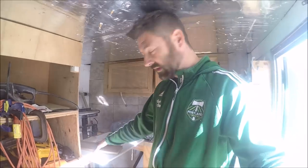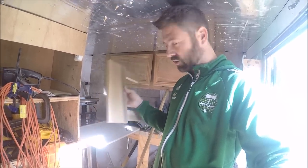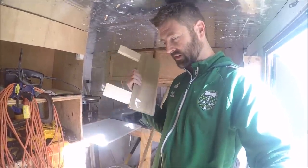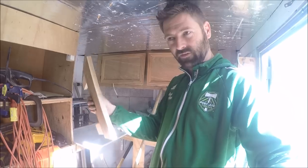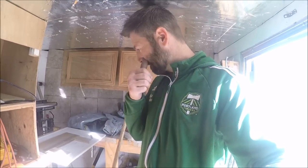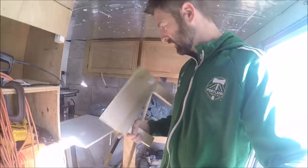Anyways, I'm getting ready to do the soffit vents, and I wanted to show my little template on how I can quickly mark out the right dimensions that need to be cut out and how they're consistent, the exact measurement off of the front side of the fascia all the way around the house. So I'm going to put this GoPro on my head. That'll look real entertaining to the people who live here. Put this GoPro on my head and just show you how I quickly can mark out the house for where all the soffit vents need to get cut in.